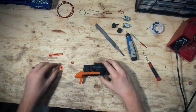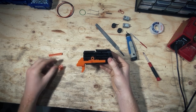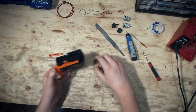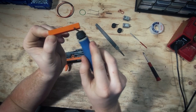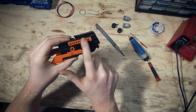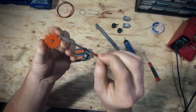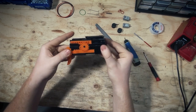We're going to work on the blowback mechanism. For these gears, you probably shouldn't need to file them, but you'll find out by testing as you go. First, test without any gears and feel how smooth it is. Then move on to the next gear — put the little one in the left-hand slot, and if you can move it back and forth without much resistance, that gear is spinning well. Add the next gear, and if that also glides nicely, the gears are combining well without too much friction. Lastly, for the blowback, I recommend taking a blade and shearing off the elephant's foot on either side so it slides smoother in the groove. If you need to file between gear teeth, use a small file and go almost like you're flossing your teeth between each tooth.